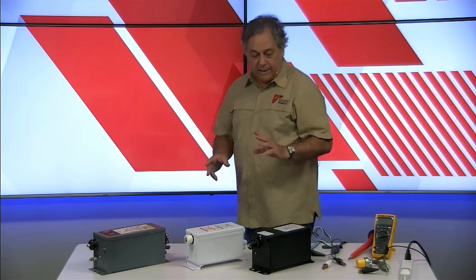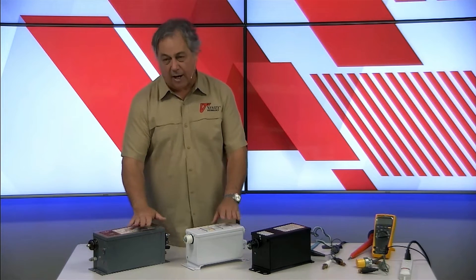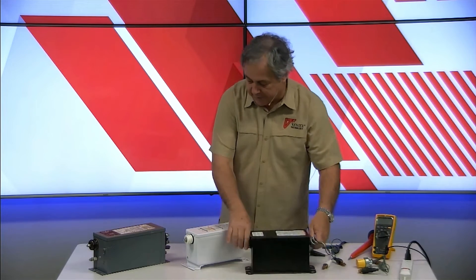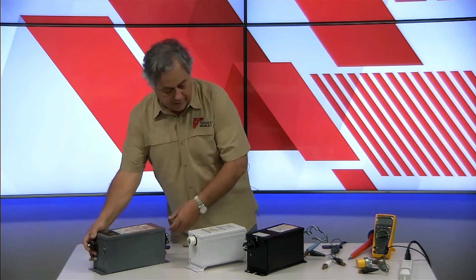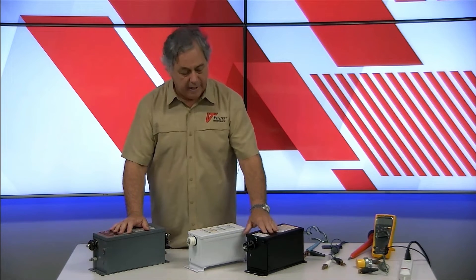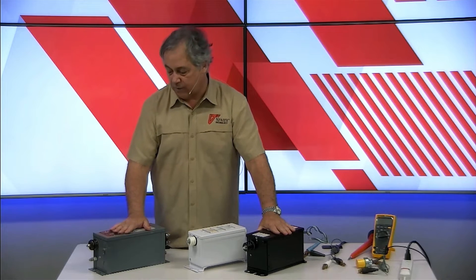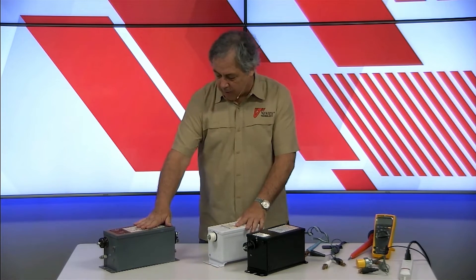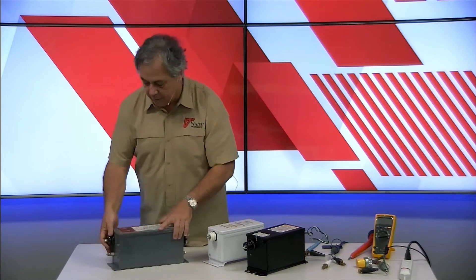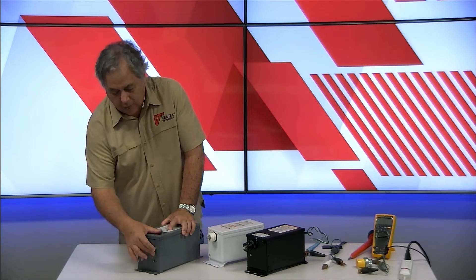To start, let's take a look at the outside of these. Pretty much close to the same size — ours is probably a little bit bigger, heights are about the same on all of them. Primaries on one end, secondaries on opposite ends on all of these. On all of these there's some kind of switch to override the ground fault circuitry, to make it easy for testing if there's a problem about something grounded out in the transformer itself. You'll notice on ours, however, there's a service ground on the primary end.